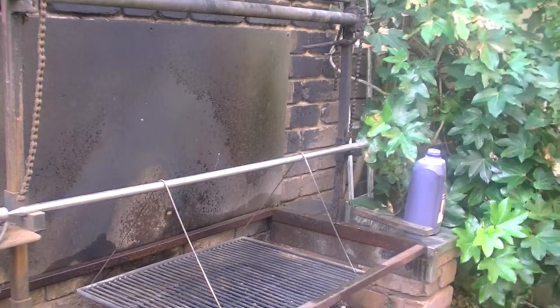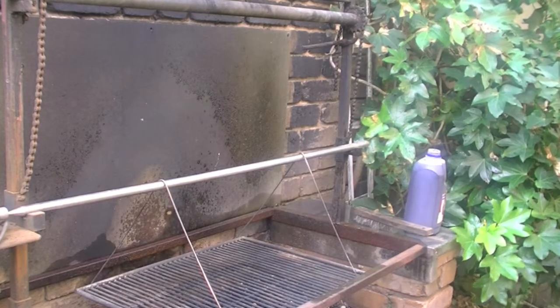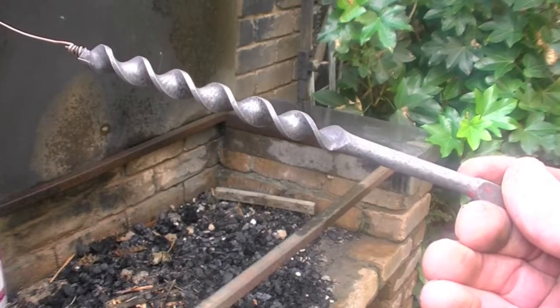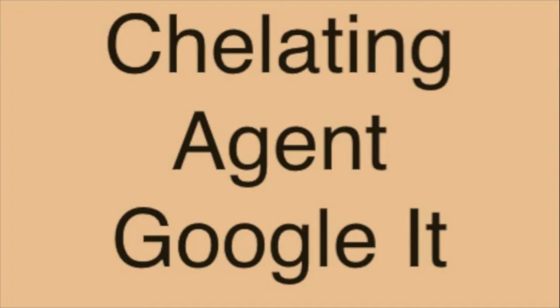So if you're going to clean some rust up, my suggestion is unless you want to pay big bucks for some proprietary rust remover, molasses is the winner. Here's my drill bit after three days in the molasses - how good is that! Apparently molasses contains a chelating agent, that's why it attacks the iron in the oxide and that's why it works so well.